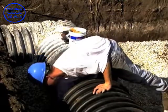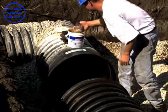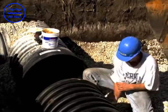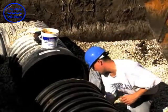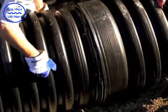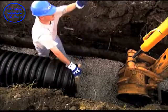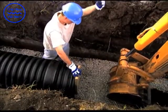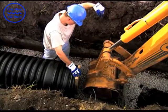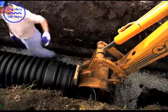Always be sure to clear away bedding and backfill around and under the joint area when joining a fitting or replacement coupler to pipe in the trench. Pushing a bell onto a pipe in the trench could easily collect debris if the area is not cleared prior to assembly. Align the pipe with the coupler or fitting, place an installation stub in the other end of the coupler or fitting, and position a board across the protruding stub. Use a pry bar or carefully use the backhoe bucket to push the coupler or fitting onto the pipe.